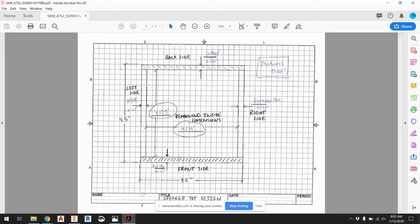And you should have completed this layout here, so we understand that the 2 important measurements are the outside dimensions of our speaker box. So it's about 4.175 tall by 4.125 wide. Yours might be different just because of the nature of how you oriented your pieces.